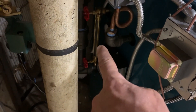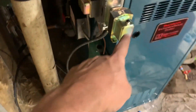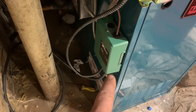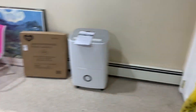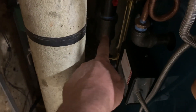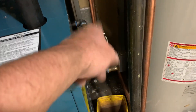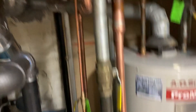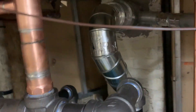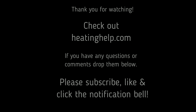On this side of the boiler we have our pressure control connected to the pigtail. Behind that is the sight glass, the low water cutoff, transformer for the control wiring, transformer for his Nest thermostat, and the zone relay for the hydronic zone in the basement. On the first floor there's a circulator with a built-in integrated flow check. That T right there is the top of our Hartford loop, and here's our return piping, aquastat, relief valve, and exhaust pipe.